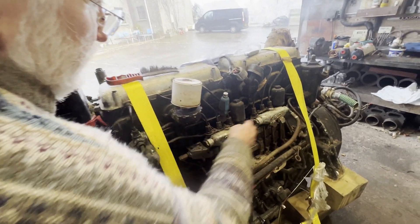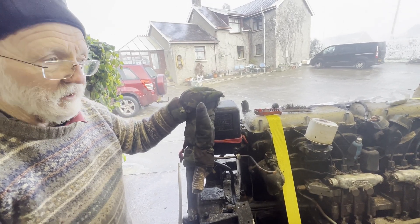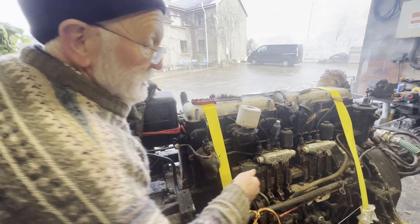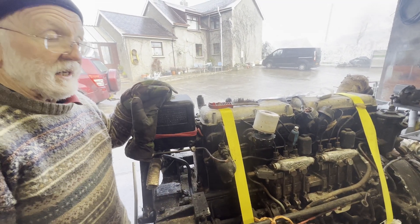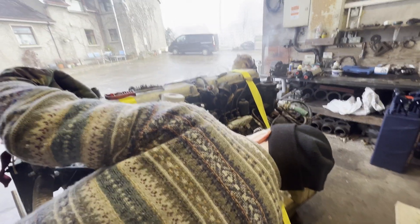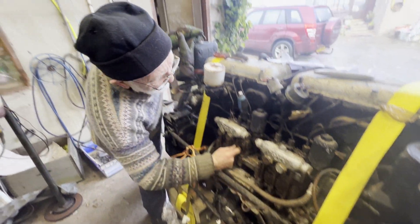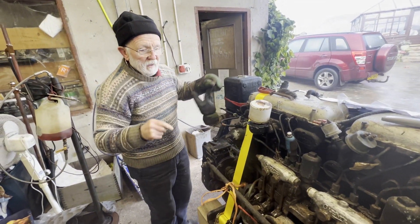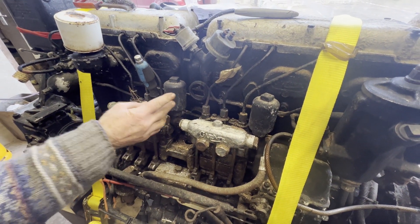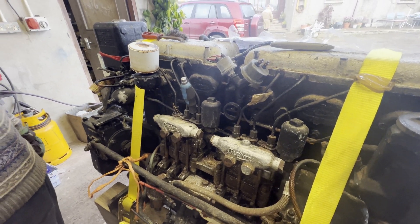They've got horizontal air vessels, which I would associate more with LXB rather than LX. We were told these are LX engines, but the pumps lead me to believe they're actually LXB. It's definitely rated at 1850. It's also interesting that they've got two air vessels on each pump top — there's no need for that, only one is required.